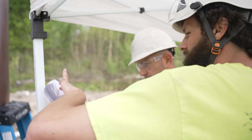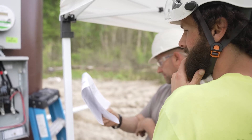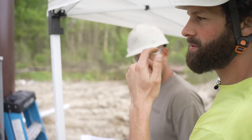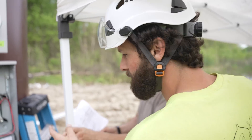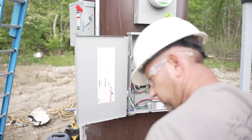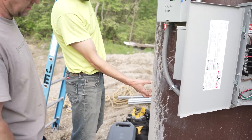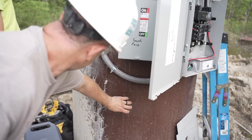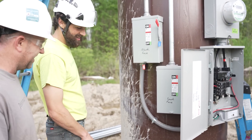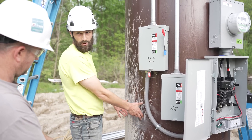Here's the IQ Envoy terminal block. That device is going to go down in a J-Box. We're going to exit the bottom of the panel with LiquidTite — since the pole is round, everything going horizontally has to be in LiquidTite. We've got the magnetic drill press over there and a battery to operate it. It's three-quarter-inch steel — beefy. We're going to drill it and tap it.